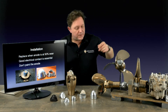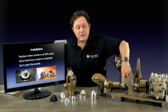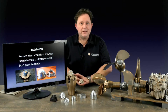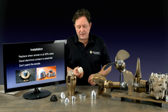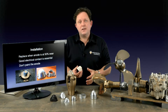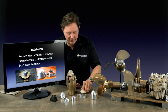As I mentioned about putting nail varnish on a tiny part just around the screws — some people don't understand how the zinc works and will stick it on the propeller and then paint the propeller. It's really, really important not to do that, because for the ions to break down in the zinc, aluminium, or magnesium, it has to be in contact with the electrolyte. Otherwise it doesn't work, and then the next thing that will go is your propeller. So you must not paint the anodes.